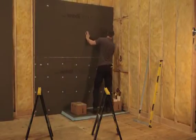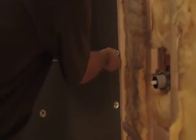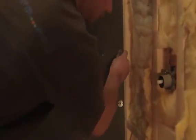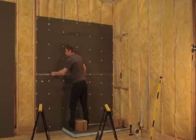Spread all excess sealant flat over the seam between panels. Keep all unused sealant and use it to cover and waterproof the WEDI fastener points. Make sure to tool the excess sealant quickly, as it will start to show a topical cure after about 15 minutes, and faster still if hot temperatures and high humidity are present, as the sealant uses moisture to cure.